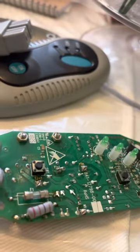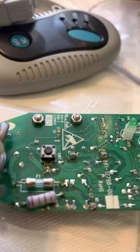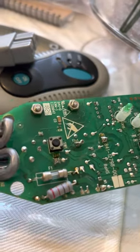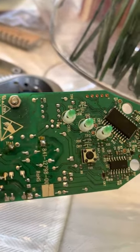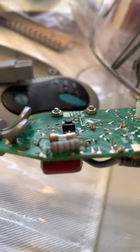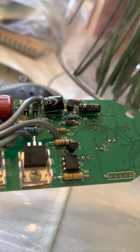Another point: if you look at the control, there's a fuse that sometimes might pop. It's not easy to replace — you have to solder it, so if you don't know how to solder, you're out of luck. Also, sometimes something on the board burns out. Visually look carefully for any burnt marks; it could be a capacitor, a resistor — many possible components. If you see anything burnt, that's another cause, and it's probably not worth fixing.